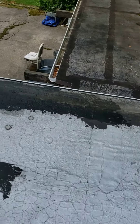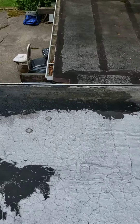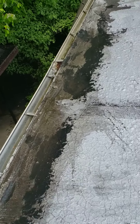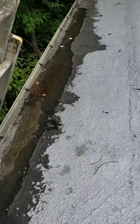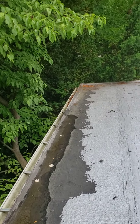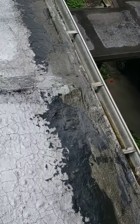This is the area where it looks like it could be getting in somewhere in this vicinity, which was already patched. This whole area at the bottom just gullies and collects water. We just swept a bunch of the water off. You could see some water over here down at the end — it just sits in there and eventually it's going to get in. It's just not pitched right into the gutter.